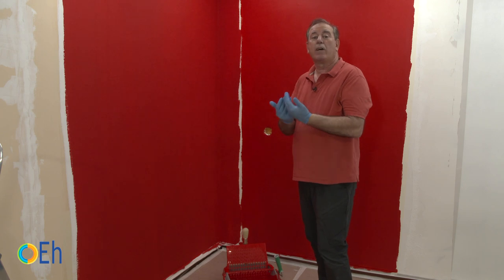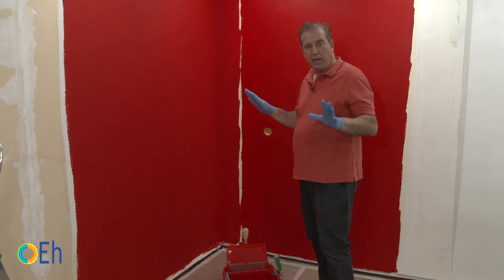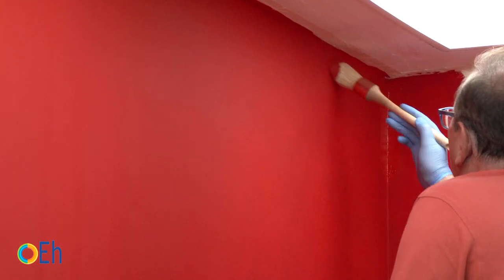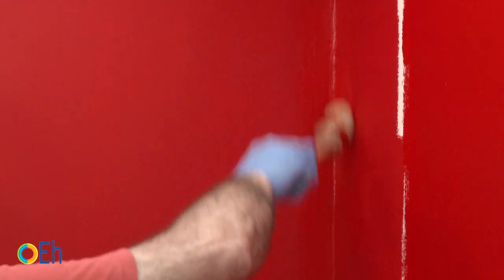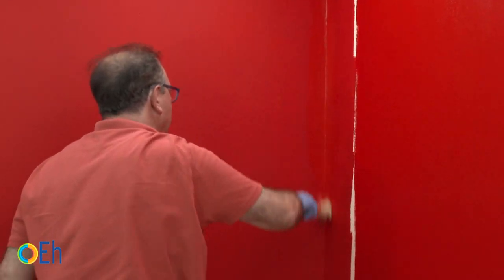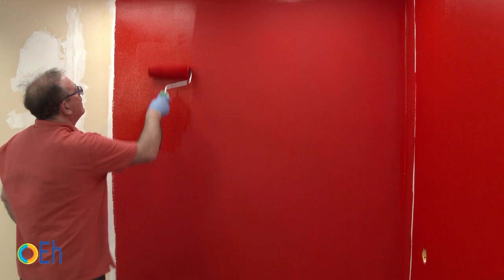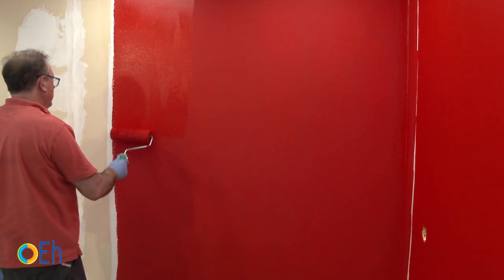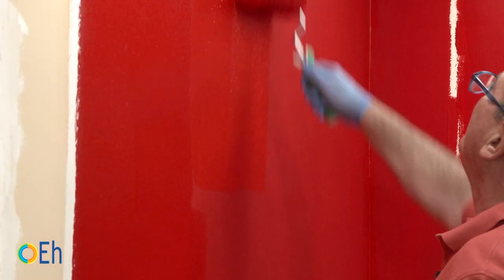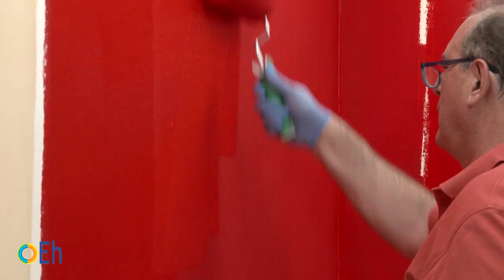When there is enough paint so that it is no longer transparent, it's going to be all even and there won't be any marks. It is important that we distinguish this — dark colors need two layers, and until they are given, it is absolutely normal that there are zones of transparency. When painting the wall we try to load the paint and spread it as evenly as possible. Especially in the second layer, it is very important that you retouch well the encounters between the different paint sections made by the roller, so that the paint sections are perfectly matched and there are no marks left.